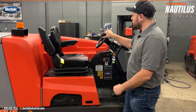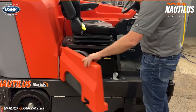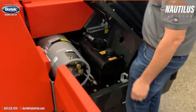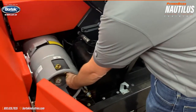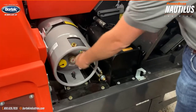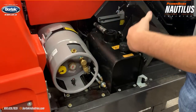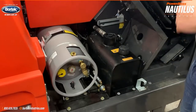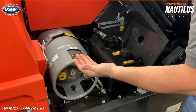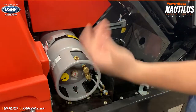With this being a propane machine, when you do get the low LP indicator warning, it is time to change out the tank. Open this door first to see your propane tank, then lift the seat up and forward. What I like to do is run the machine after shutting the propane tank valve — turn the machine on and it'll run for about 10 to 15 seconds to clear out all the propane in the line. Once that's done, the machine is going to die on its own. The reason is that if you disconnect the hose before doing that, propane is going to shoot out and it can actually burn your hand. After running the machine clear, there will be no propane left in the line. You can safely detach your hose, put your new propane tank on just like a forklift, and you're good to go.